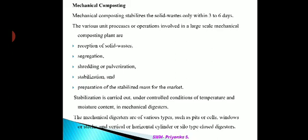So you can use magnetic separators for removal of the magnetic material, that is ferrous materials, which will attract magnets and they will be separated out. Then other non-combustible organic matter such as paper, rags, cardboards, non-ferrous metals, etc., are also separated out manually for recycling and reuse. So this is done in the second step, that is segregation. You are segregating the waste.